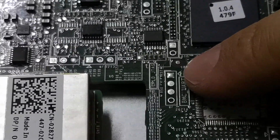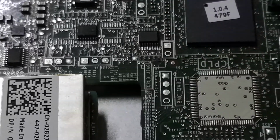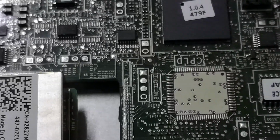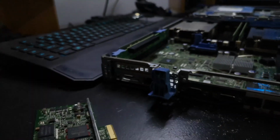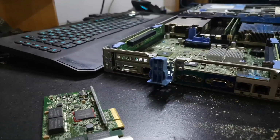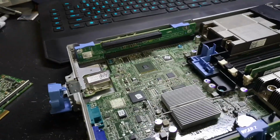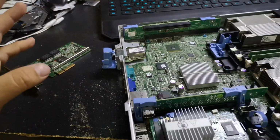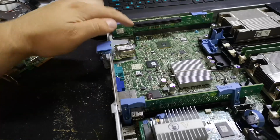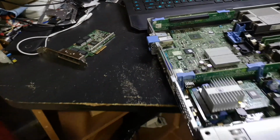So apparently pin 1 is 3.3 volts, then it's RX and TX and ground. Supposedly, hooking in through this port and connecting via serial, you can send some commands to load firmware off of the SD card on the Enterprise iDRAC card port. So you'll need the Enterprise add-on card. They're not expensive. I'll mention, if your iDRAC is bricked, then getting a new one of these cards won't help you. This just adds the management interface.